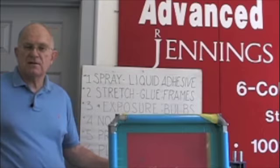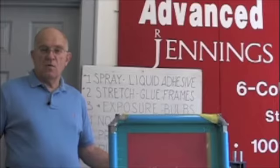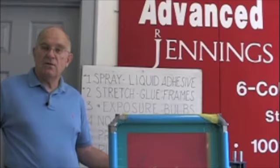That leads you to flash curing, and flash curing is a killer on productivity — you want to avoid it. All the dominoes fall, and there's more. People who have low-tension screens typically wipe the bottom of screens. If you have properly tensioned screens, you will never wipe them. You can't stop an automatic press printing a thousand shirts an hour to wipe screens. So why should you as a manual printer be stopping to wipe screens? You're wiping because you don't have the right equipment and the right knowledge. It's simple.